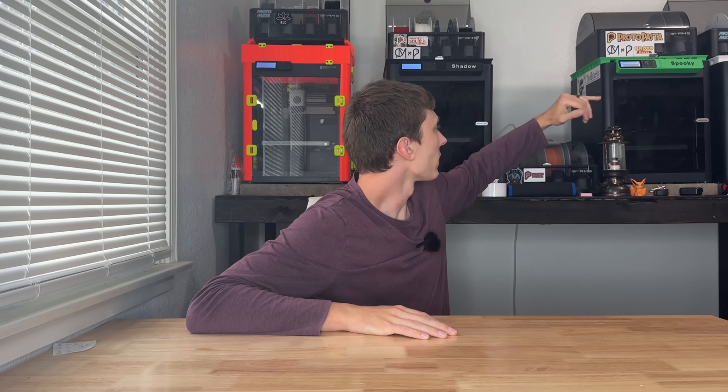The things I've replaced the most here — believe it or not — the printer itself, I haven't replaced too many parts on it. I haven't had to do a ton of maintenance. I prepped for the printer needing parts, especially coming from an Ender series where the hot end was basically garbage. But it turns out the AMS is really what causes you the most trouble. Most people are going to end up getting an AMS for multicolor. I have six AMS units and four printers, and as you add more, you run into more and more problems. Most of the replacement parts are for the AMS — it definitely shocked me at first.